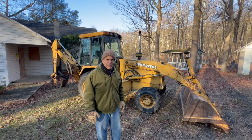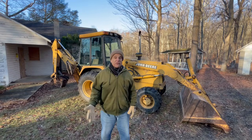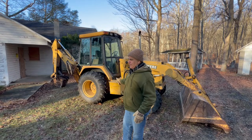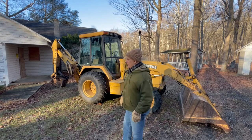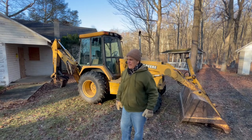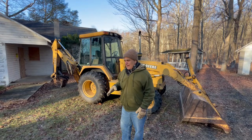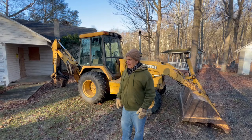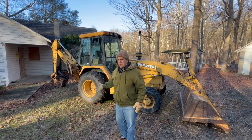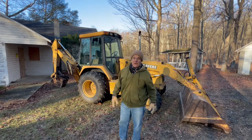I asked a friend that's in the auto body business, so there's lots of welding on cars, and he said that really shouldn't have done it. But now it's freezing, so I'm going to see if the thing will fire off. I got the start aid on it, which is just starting fluid, hooked up to the machine. I'm going to see if that'll help. If not, I'm going to try jumping it with the truck. If that doesn't do it, I'm going to have to get some batteries. Now, I noticed that the last few times I've been starting it, it wasn't firing over so quick. And this backhoe is new to me. I don't know how old this battery is that's in there. And I guess we're going to find out.